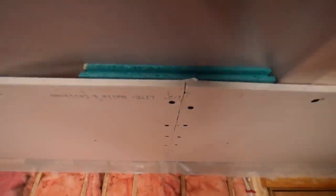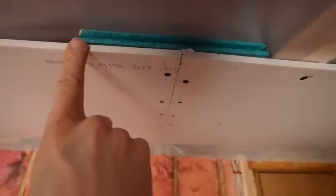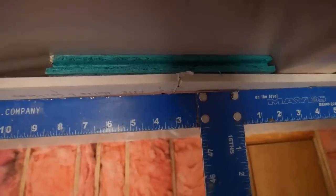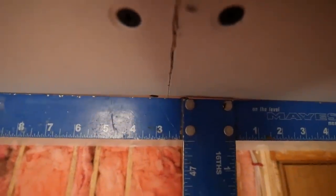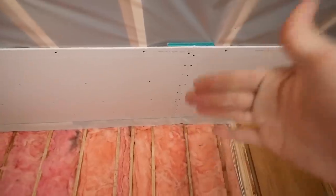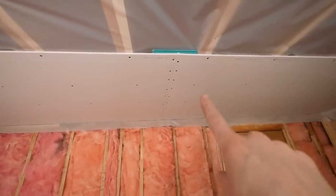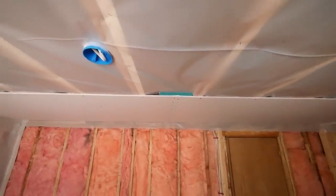Our butt joint was floating and we created this butt board to attach the two sheets together — it's just as strong as if it was on a joist. Because we put those cardboard shims here and here, it causes the board to bow in toward the center and creates its own taper. You can see there's space under there — we created our own artificial taper. The drywall sucks up a little bit and that space lets me put my paper and compound when taping seams, so it'll be smooth with the ceiling and not a hump. If you had them both ending on the wood naturally, you'd have to create a hump to hide it, and that's really difficult. So that's how we're doing it — we're going to have a perfectly flush, level ceiling when we're done.